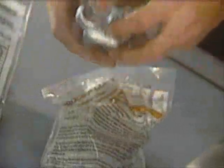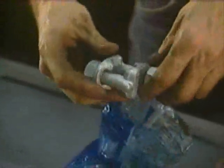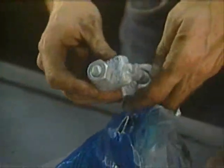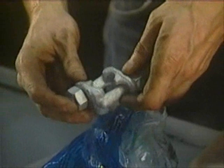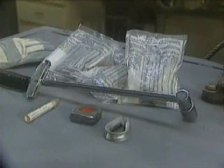In addition to the G450 Crosby forged red U-bolt clip, Crosby also manufactures the G429 forged fist grip clip. The forged fist grip clip does not have a U-bolt but has two saddles. Although the installation instructions for the fist grip clip are very similar to those of the red U-bolt clip, the number of clips and the torque required does vary. The installation of G429 Crosby fist grip wire rope clips starts with gathering the required tools: tape measure, pliers, and torque wrench.